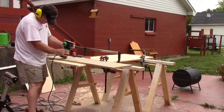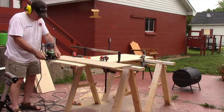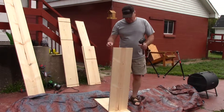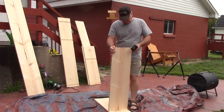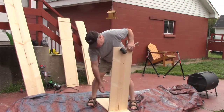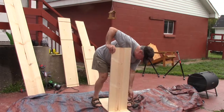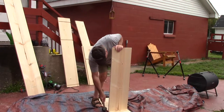That dado bit really worked well. They fit tight, but I'd rather have them that way than being really loose. I ran and got that board that I needed this morning and cut it to length and rounded over the edges. Now I'm going to give it a shot putting this thing together. I'm just going to dry fit it and see how everything looks. I'm a little worried about the dados that I cut because they look like they're real tight, so we'll just have to see what happens.